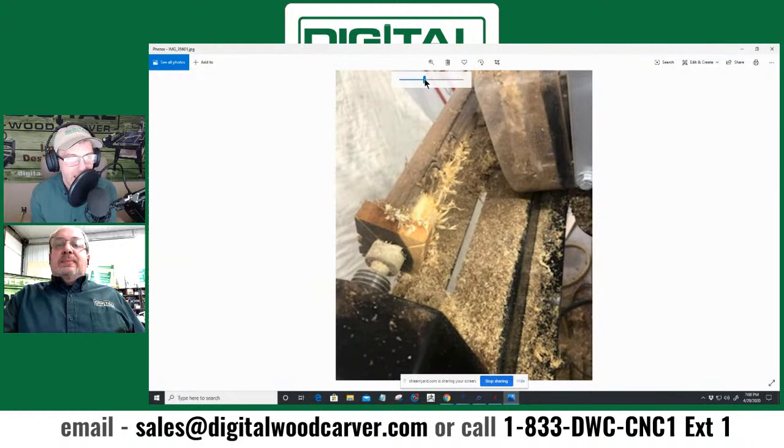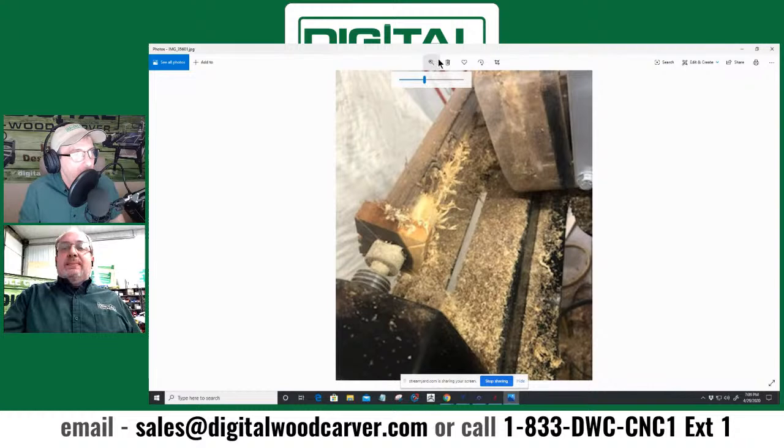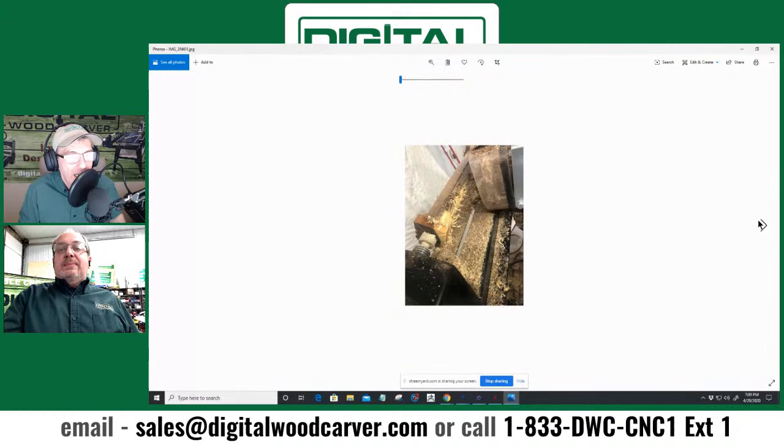Now, this photo you see on the screen here, now we're getting into the roughing stage. This is where all the little fibers are starting to rough up because it's got that quarter inch end mill, and it's hogging away the waste material to get it out of the way for our finish cut. And on our finish cut, we used a 16th inch tapered ball nose bit to just bring out the detail.